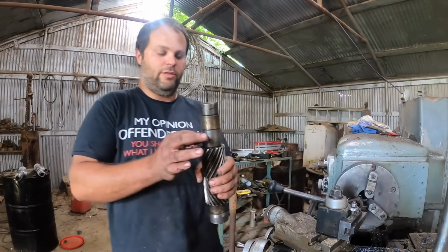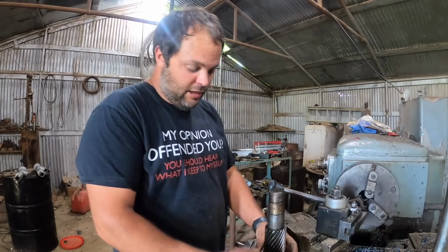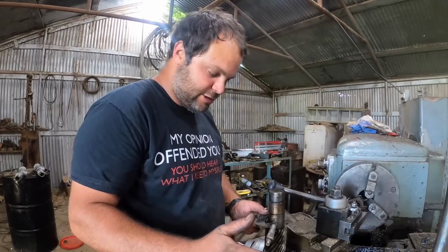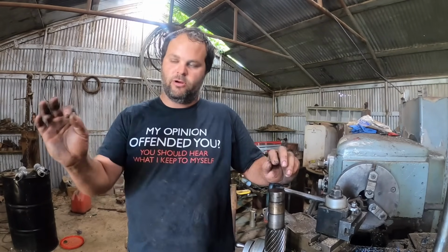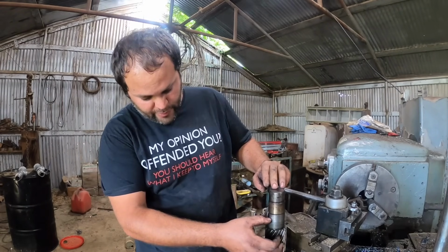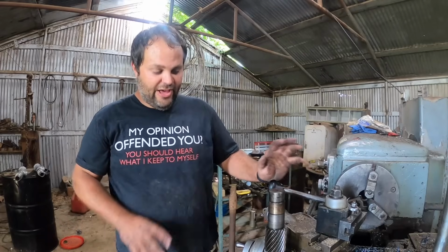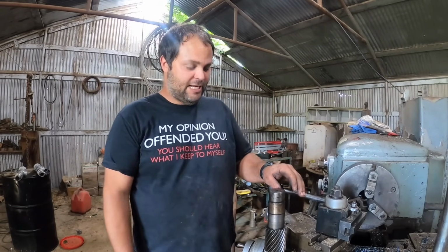Okay, so here's the gear. This part right here is where that gear presses onto this gear. This measures between 2 and 2 1/2 thousandths over 1 7/8. So this is actually about a 1/2 thousandth smaller than that other gear. It won't quite slide into it, but you can start it in there and kind of turn it by hand and work it on there about this far. I took a rubber mallet and whacked it and drove it on that gear. That won't work. The only thing that holds that gear on is the press fit. It's got to be tight.